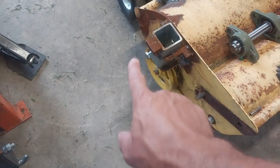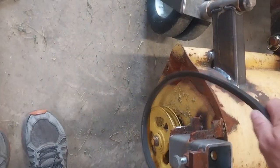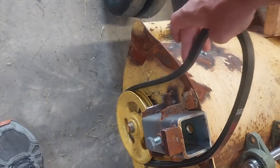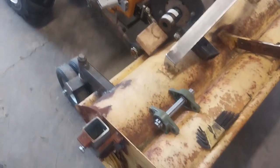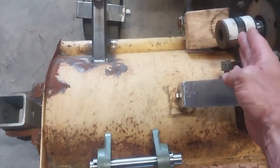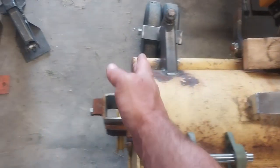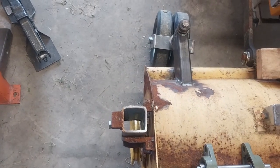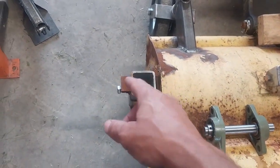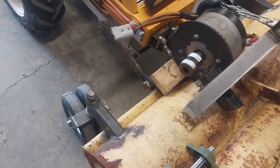The motor actually just moved all by itself because it's sitting kind of precariously. I have a 7/8-inch shaft. This is the coupler that was on my pressure washer, which I used about three times since I built it. So I could just have a couple go from here across the 7/8-inch shaft, supported on either end by some bearings, to a pulley with some sort of an adjustment. The problem I see with that is as you adjust this, it's going to have to pivot off of something — probably this back bearing — so when you adjust up and down to take up slack for the pulley it's going to follow an arc, and that's going to put a strange twisting on this lovejoy, and I don't want to do that. I think what I'm going to end up doing is heading over to work, looking around in the scrap bin, and seeing if I can't find a nice piece of 7/8-inch rod that's roughly that long. Probably go ahead and machine a keyway on one end, figure out where that's going to be, find out the length, cut it off, and then just for mock-up purposes put all the bearings in and come up with some sort of a motor mount.